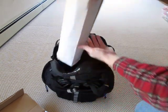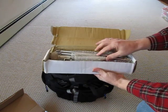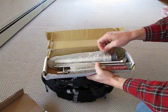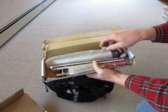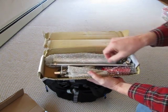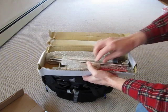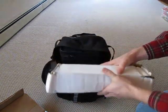The other antenna I bring with me — the box is a little beat up — is called an MP1 by a company called Super Antenna. It's basically a manually adjusted screwdriver-style antenna. It's got an adjustable loading coil, a telescoping whip, a tripod, and a little 80-meter coil. A nice little portable vertical antenna that works really well.